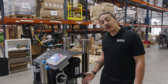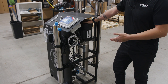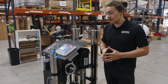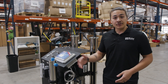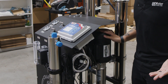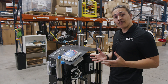After the water flows through our pre-filter, we pass it through a multi-stage stainless steel centrifugal booster pump. This is where a lot of competitors cut corners — they'll use things like rotary vane pumps or diaphragm pumps, which over time become consumables that need to be replaced every two to three years. We chose these pumps because they're built to last, and with stainless steel internals, they're ideal for processing high-purity water.